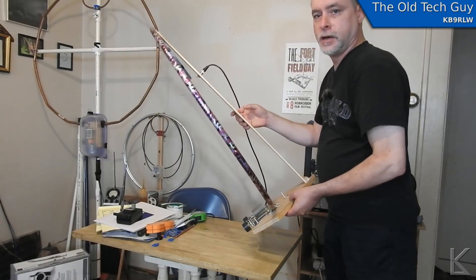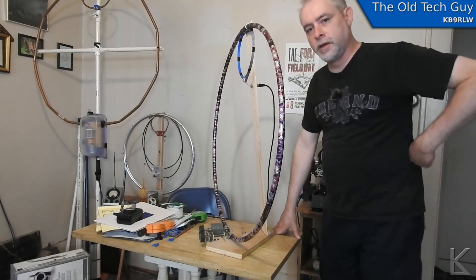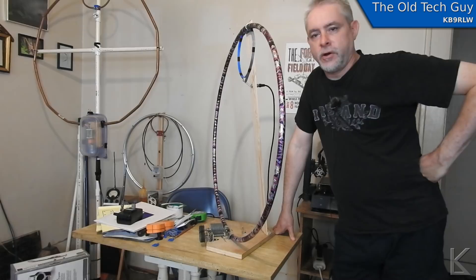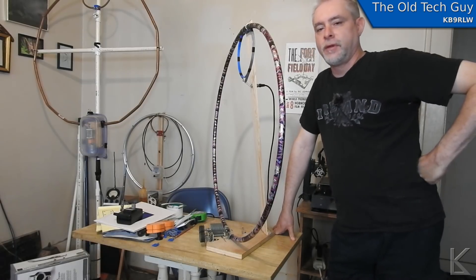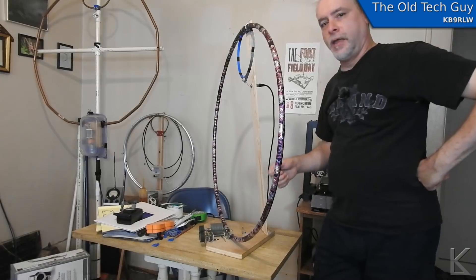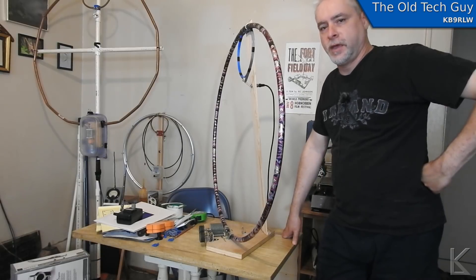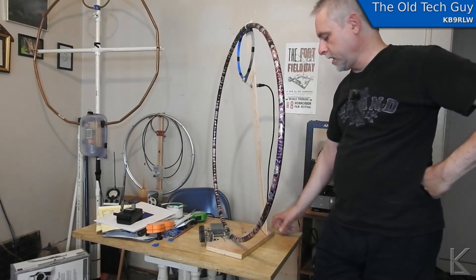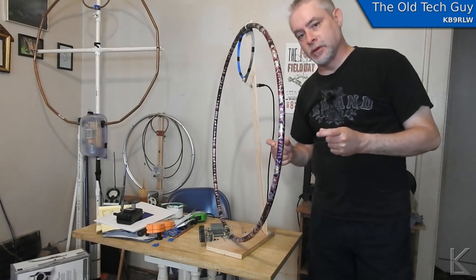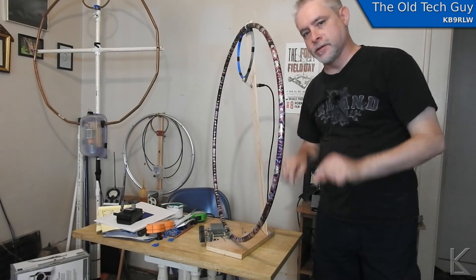I left it together for now because I'm really only interested in 40 and 20 meters for QRP night. The antenna fits in the back of my car just fine and can be placed on a table in one of the rooms at the old fort right next to where I'm operating. Paralleling a smaller variable cap with your big variable cap makes tuning a snap - you tune the big cap until you hear the noise peak on your receiver, then quickly fiddle the small cap to get your SWR down to the lowest. I'd recommend doing that on your magnetic loop designs. You also want to use as thick a conductor as possible to connect the capacitors and to connect them to the loop itself, to keep resistance as low as possible for efficiency.